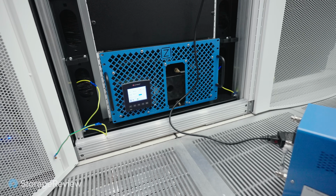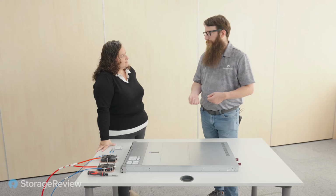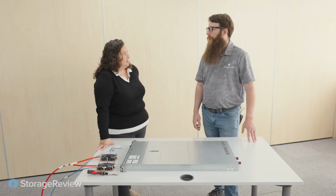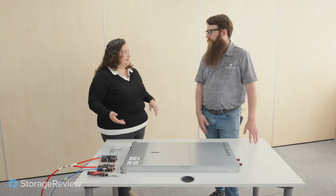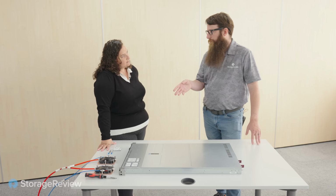You can reuse the heat, of course, when the water comes out from the primary. Kind of like a traditional heat exchanger that I would see in pretty much... Yeah, it's a plate heat exchanger that we're using as a condenser. So warm water goes in, hot water goes out. And of course, it condenses the vapor back to liquid on the other side. So what kind of pressures are running inside these tubes?